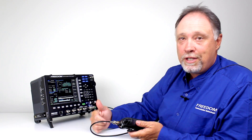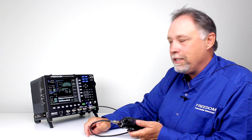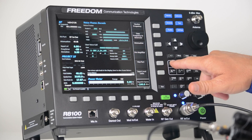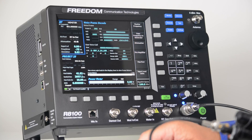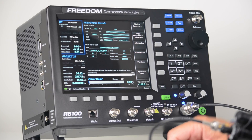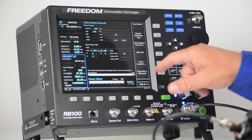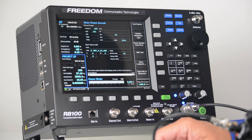Now I want to test the receiver of the radio to determine if I've got proper sensitivity. I'm going to go back to the RF zone and copy the frequency to the generator so that when I go to generate mode I don't have to re-enter that frequency. Next I'm going to go to the P25 zone and copy the NACK to the generator so I don't have to re-enter the NACK code as well.